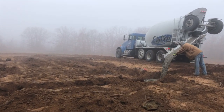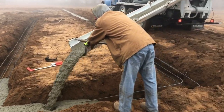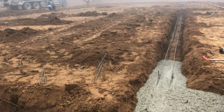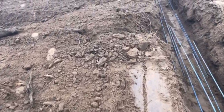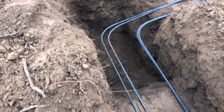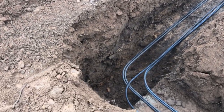We have a callback anticipated to finish up what's not done. You can see they've got the north end almost done. What he's doing here is pulling that up first because it's dug down to native soil. Right here in the corner, because we do have so much fill here, you can see he's built up and up already. This is essentially half-inch rebar with three-eighths inch pins, and we build our cage inside the hole. There's getting down to native right there, because we did bring the front side of the fill — that's going up so high in the air, I think we've got three and a half to four feet of fill back down to native.